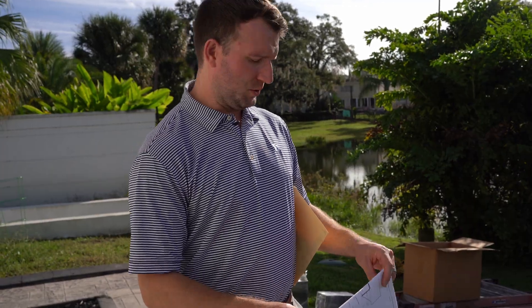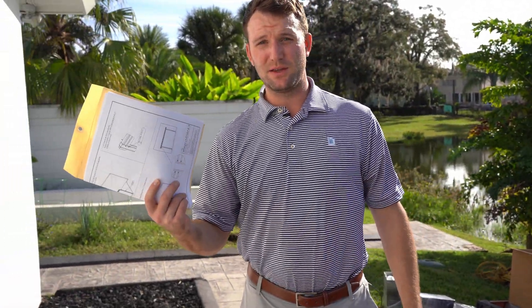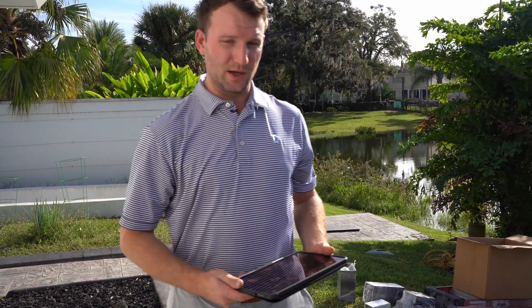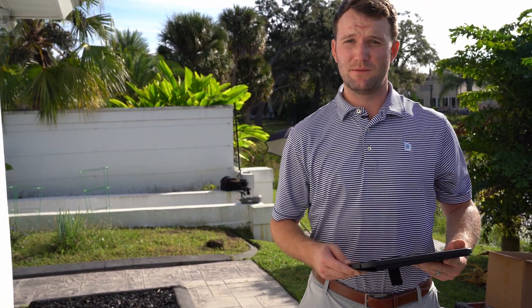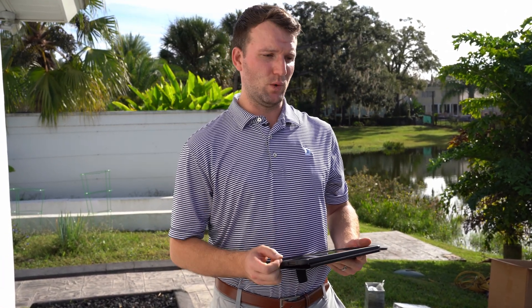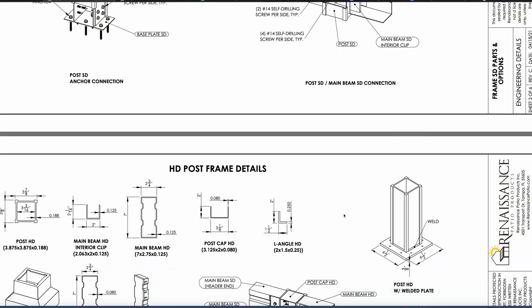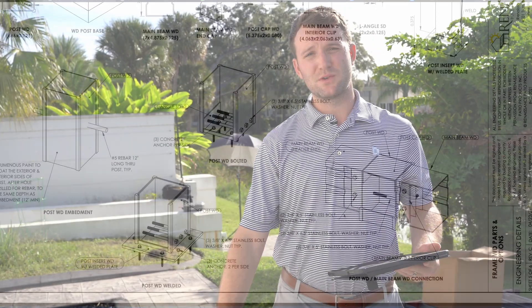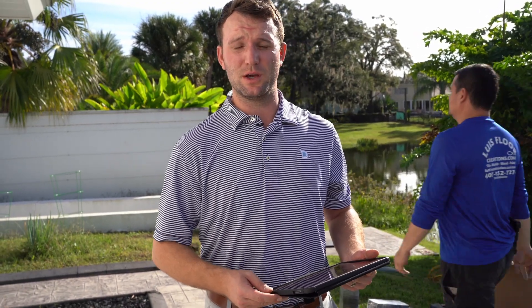One of the first things you want to do on site is take your iPad, pull up the connection details, and verify what style of framing is shown with the kit. In this circumstance we're using wide framing WD — a 6x6 post and 5x7 beam. That framing style has slightly different connections compared to standard framing, heavy-duty framing, and wide posts and beam with inserts. Compare those connection details to what material is actually on site to confirm which framing style you're using.